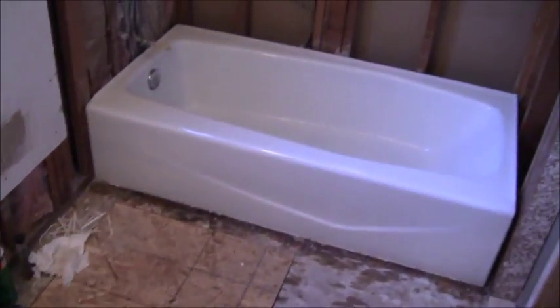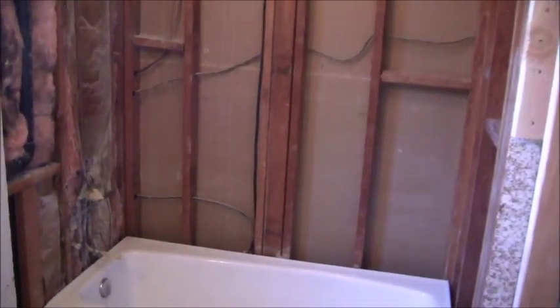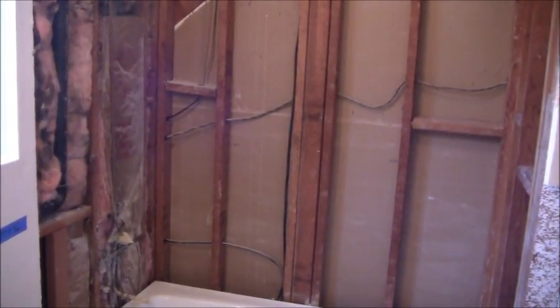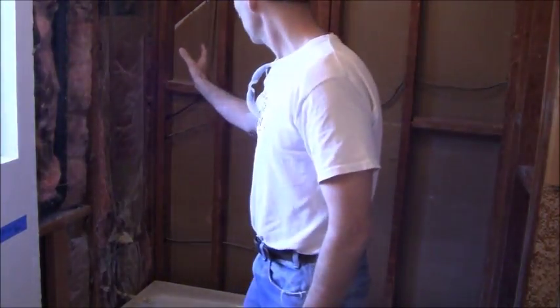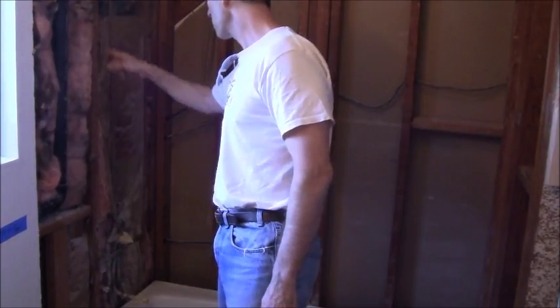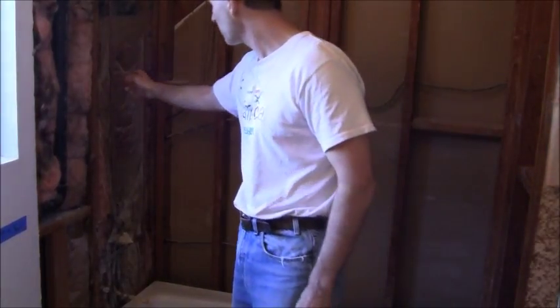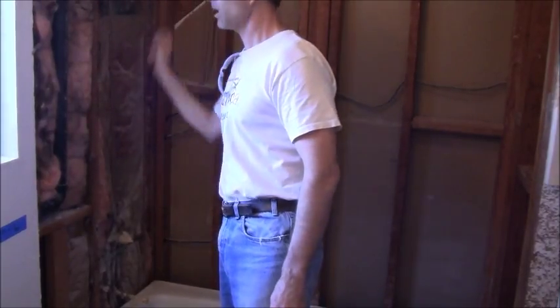So next step from this project is to figure out what I'm going to do with this shower. My intention with the shower surround is to tile it, and I would like to build a niche. I decided to put the niche on this wall right here, because I've got two studs exactly 16 inches on center, so a niche will fit. I'm just going to do a prefab niche right in there. I just have to take this copper water line, route it through here, come up, route it back, and then come up there.